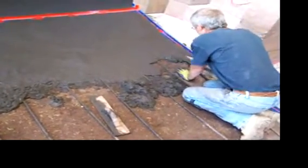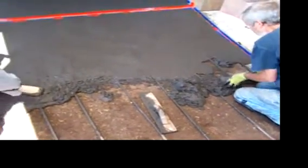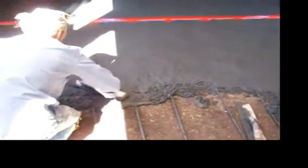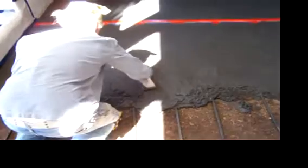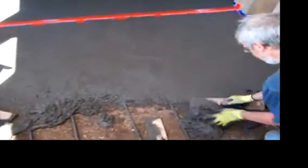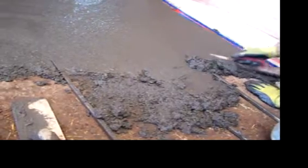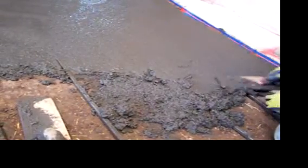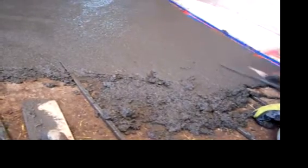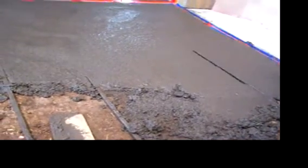This is Norbert laying mud with our half-inch screed sticks. And then our friend Alejandro over here. I'm going to move in so you can see closer. We're piling it in and then we're going to screed it off with our wooden trowels. Scrape off the excess, of course. Then pull the sticks back and work them down and fill them in with extra mud and smooth it out like you would plaster a wall.